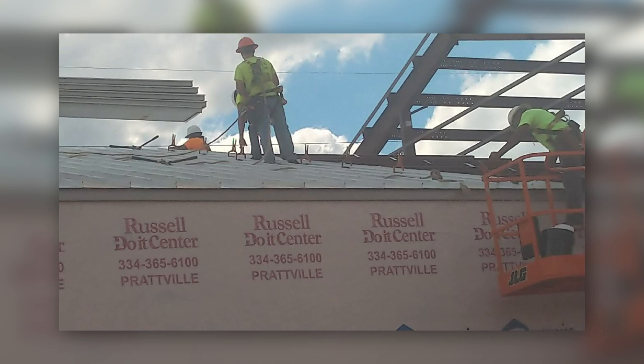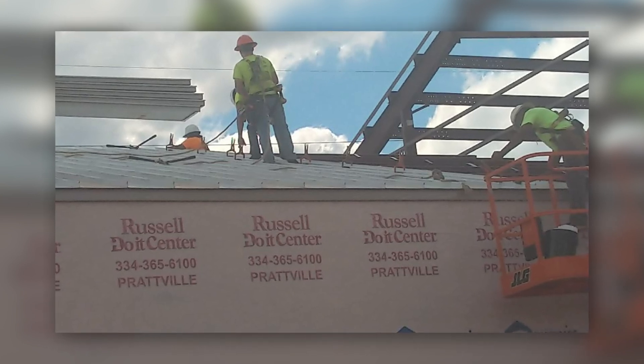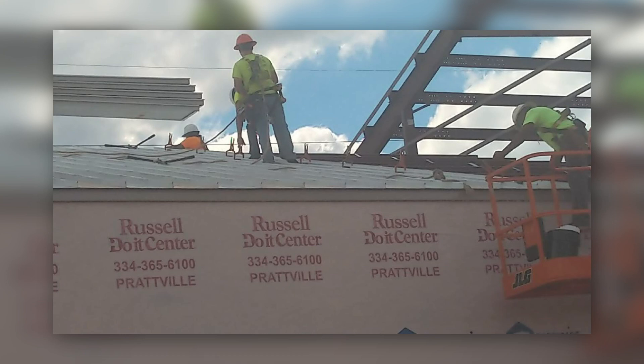The panel has a taller leg, and generally the taller the legs are on the panel, the stronger it is. With the 180-degree seam, Sheffield also performs foot traffic testing, where a concentrated load is placed on the center of the panel. This simulates conditions when you're up there installing on it — if you have a five-foot span, that panel is the only thing between you and the ground, so you need to make sure it stays together during installation and future maintenance.